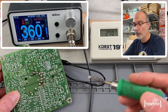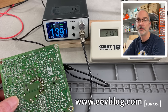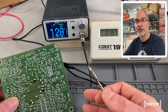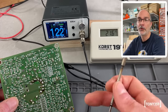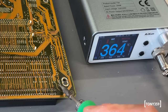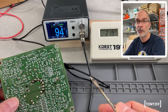That's scary. I don't want 440 degrees on my PCB, especially if the station is not telling me that's happening. I've been discussing this with online communities — the most useful was definitely EEVblog from Dave Jones in Australia, thank you guys for your help. What I think I understand is that when the board is grounded and there's a ground plane on the board, that interferes with the ability of the circuitry to read the thermocouple reading inside these cartridges. JBC obviously managed to sort it out with some electronic wizardry. This station apparently is not very good at doing that. With firmware 1.33, the display will intermittently show 'no tool', and it will still spike to stupid temperatures. 1.34 doesn't show that error anymore, but it's still spiking — the display is not reflecting that spike.